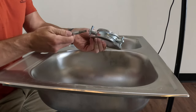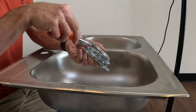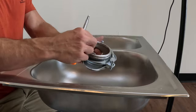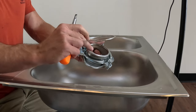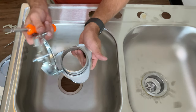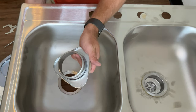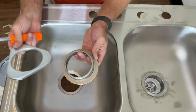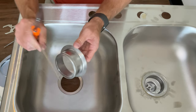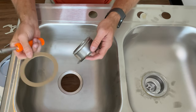That exposes the compression ring. To remove the ring you can take a screwdriver to the end of the ring and sort of pop one end out, then work your way around and the compression ring will pop off. That little ring is actually what holds this whole thing together. This little cardboard ring is a slip ring — do not throw this away, you will need this piece.